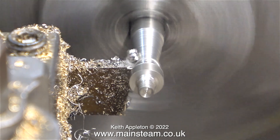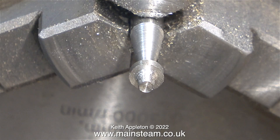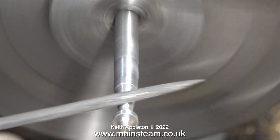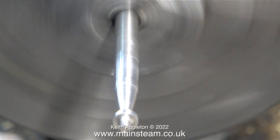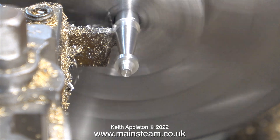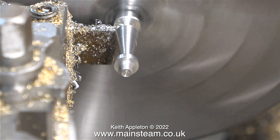If you're not very experienced doing this sort of thing, I would suggest practicing on a piece of scrap metal. I've done similar jobs to this hundreds of times over the years, and it's quite simple once you know how to do it. The part's been turned to the right shape — it just needs cleaning up, starting with a needle file. You will notice that I've pulled the part out of the chuck so that my hands and the needle file are not too close to the chuck itself. After using a piece of emery cloth followed by wet-and-dry sandpaper, this is the finish I got on the handle. In this clip I'm parting off the finished handle, but I'm not going straight across with the parting tool.